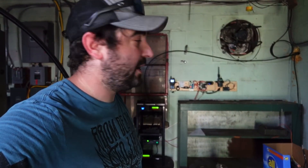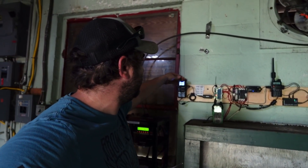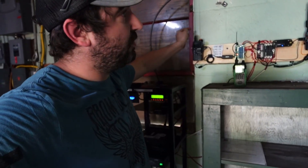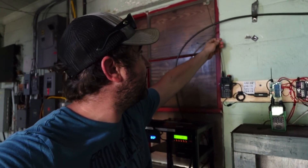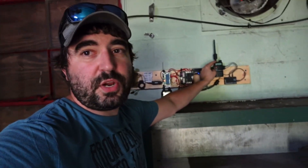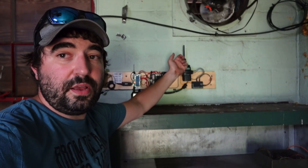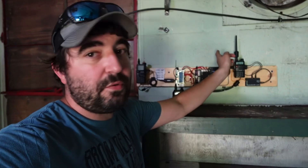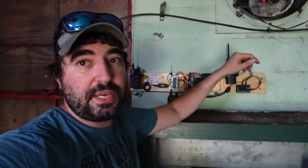You can get a few miles away with it inside the building like this. This is just a simple BNC adapter — you could run this to a coax outside, put it on the roof and that would work out well. This one seems to be receiving pretty well. For our transmit, where it announces back to us, I get about three miles with it. We're in a cinder block building, but if I run that antenna outside it works fine.